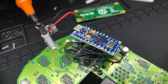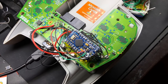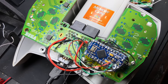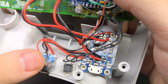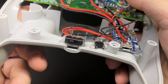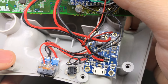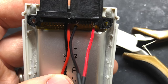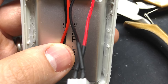By applying power to the right pin where the chip was, we can read the voltage from the corresponding pins and figure out where they are. I've got everything connected to a cheap SparkFun Pro Micro clone, and the USB pins on that are connected to some of the pins on the VMU connector — so when you plug it in, it's like plugging in a USB device. Underneath the PCB I've got a power boost in a pretty standard setup, with the battery pins connected to the corresponding pins on the battery memory card so it charges that up. The 5-volt output is connected to both the Pro Micro and a couple pins on the VMU connector so it'll charge the VMU when you plug it in.